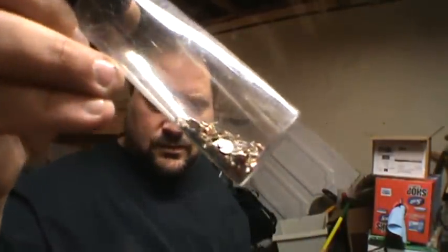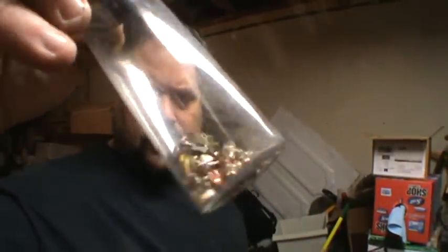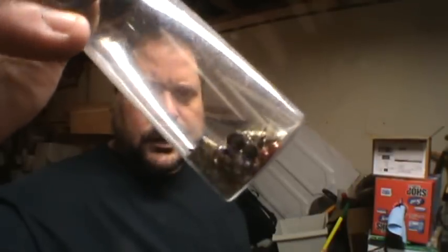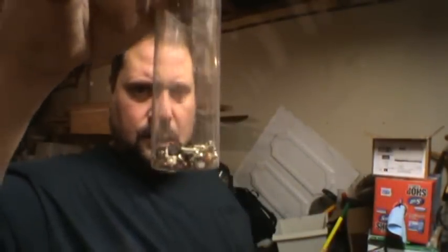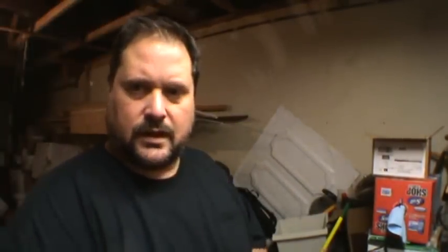This is about 30 to 40 grams of silver. There is a little bit of copper in there, but you give it a bath in hot hydrochloric acid and the copper should come right off, along with any of the other metals that are attached to it.